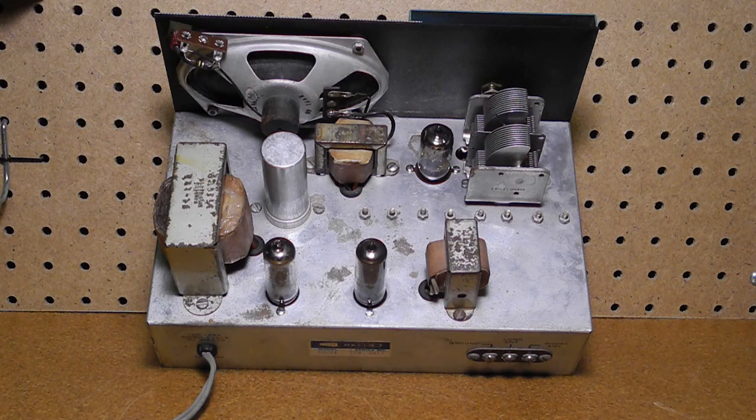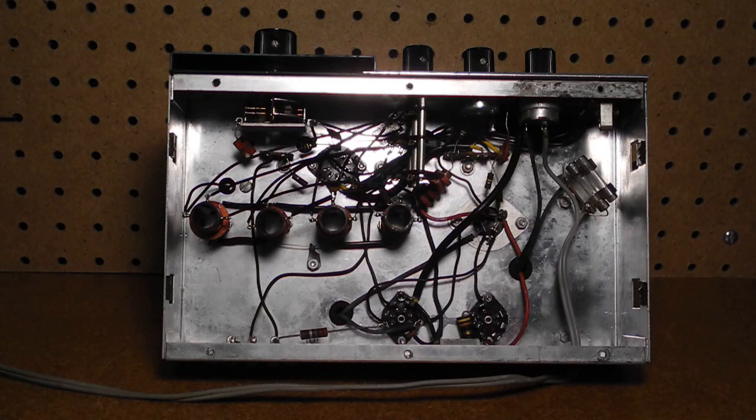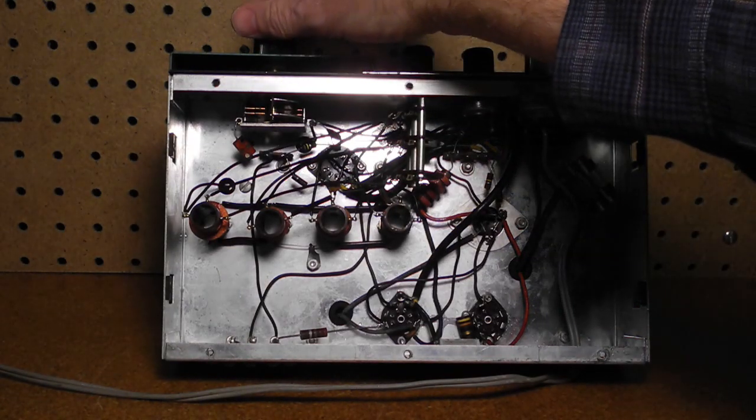The headphone jack circuit is a little unusual. When headphones are plugged in, they're in series with the speaker. But because headphones are typically much higher impedance, the speaker audio is then almost zero. If you plug a speaker into the headphone jack, both speakers will operate at about the same level. Underneath the chassis, you can see all wiring is point to point. Each of the four bands has a separate fixed tuning coil. With this circuit, no alignment is needed or even possible. The dial is not particularly accurate, but pretty good considering there's no calibration. There's a fuse as well as a holder with a spare fuse.